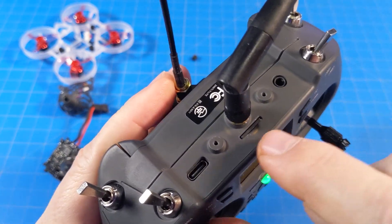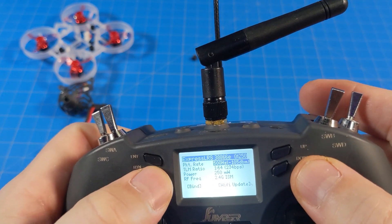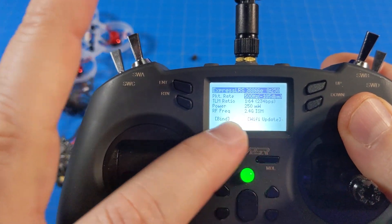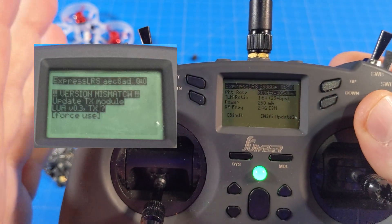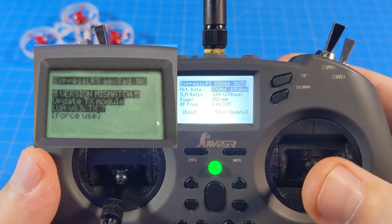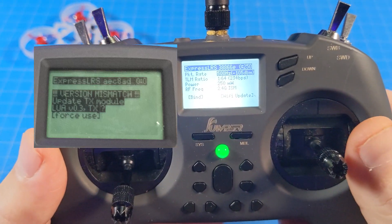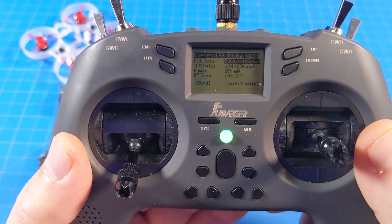You also need to have an SD card in your radio and you need to use the ExpressLRS Lua script that you see right there at the top of mine. If I hit enter on that, then you get this menu. First time you do the updating — a little tip — you'll get a warning on screen. If you get yours before I get my video out, just know that you'll get a message on the T-Lite giving you a warning. One of your options is to force — go ahead and select force. That then fires up the wireless of the module and you'll be able to connect to it. Then you do an update and everything will be easy peasy from that point.